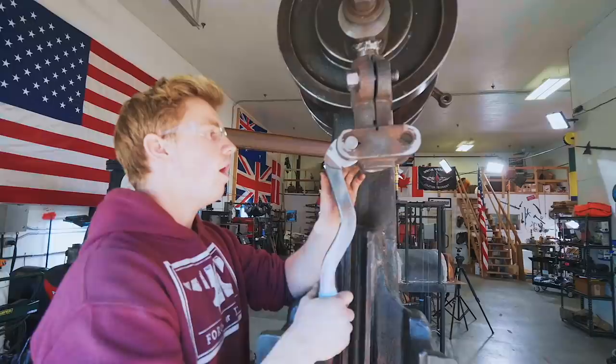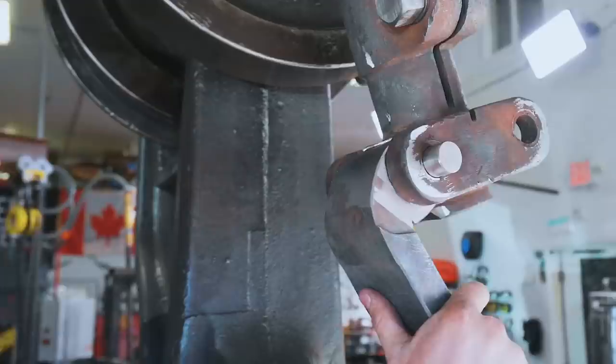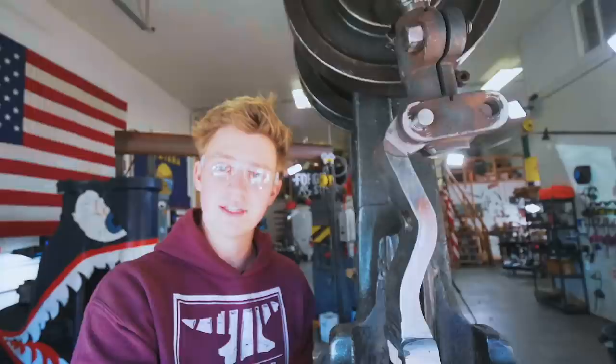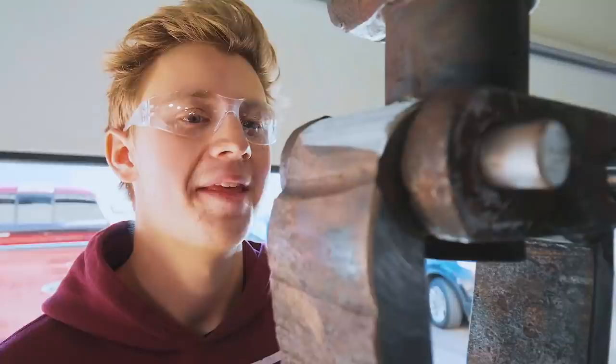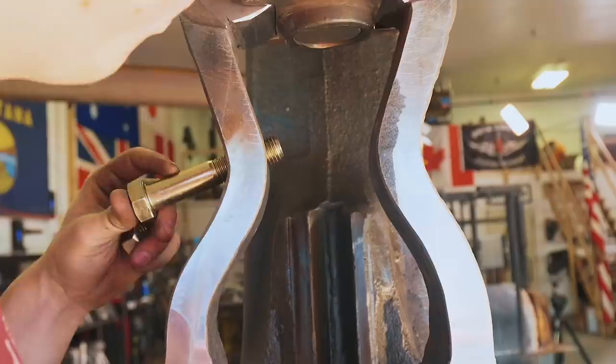We got the first one test fit in here and it doesn't look like there's room for both washers. It also looks like the ears are bent out — that wouldn't surprise me based on the fact that this whole hammer is beat to heck. That is not the sound of a happy crosshead — that is the sound of some very, very sloppy holes. We might have to bush these wallowed-out crosshead holes. We're going to try to put the whole linkage assembly together and see how it works out.